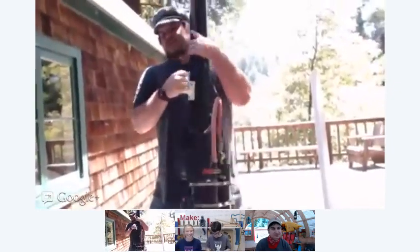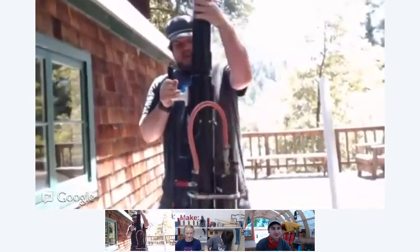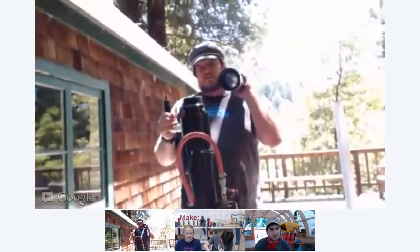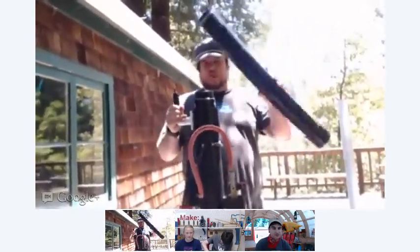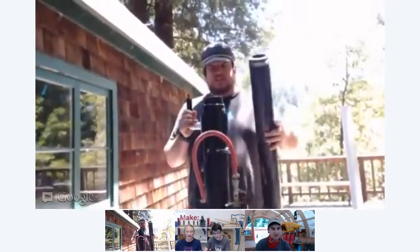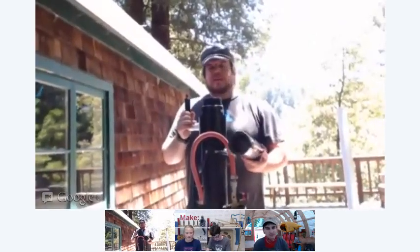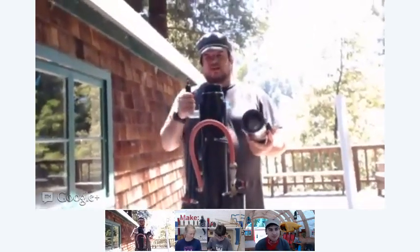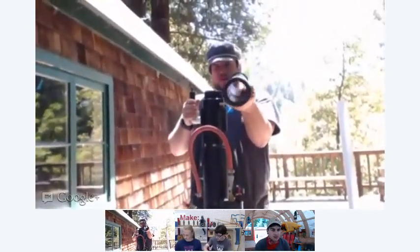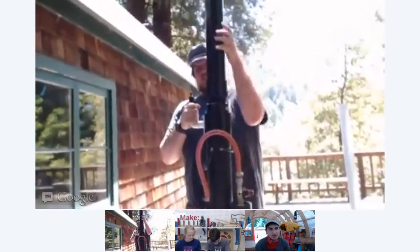In addition, I also have a different barrel. What I did is I put a male threaded fitting on the end of here, and then I just need to have a female threaded fitting on the end of my barrel, and I can use different barrels. This barrel is designed for soda cans, and it's 3-inch ABS. It's actually two pieces. I sleeve one normal size 3-inch ABS pipe inside another one after I've cut a slit in it, and it creates the perfect diameter for soda cans. So that's a pretty custom barrel for the soda cans. Yes.